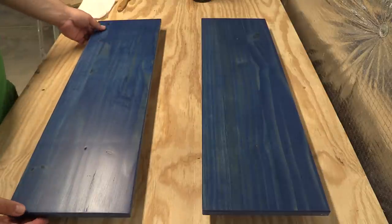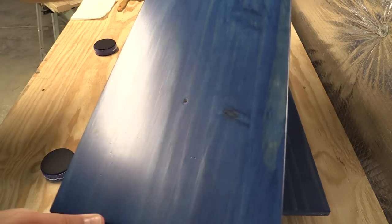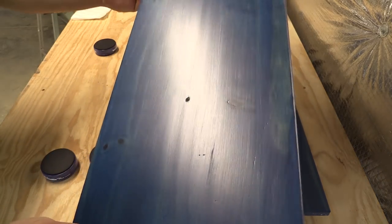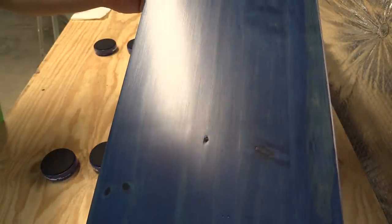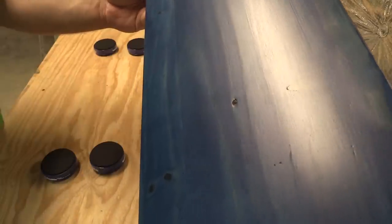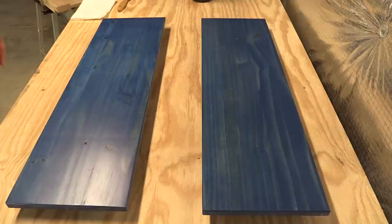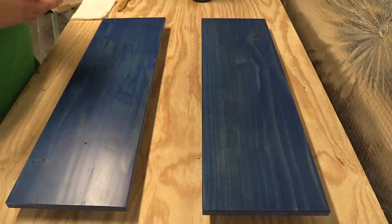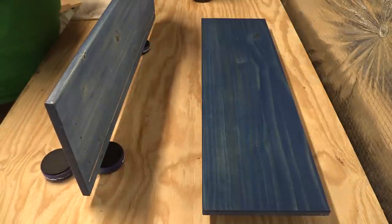This time you'll notice that's a much smoother finish on there. The finish is filling in what we sanded down last time, and you'll notice fewer brush strokes, although they are still visible. I'm going to hit these with sanding blocks, and this time — since I didn't do it last time — we are going to hit the edges as well.